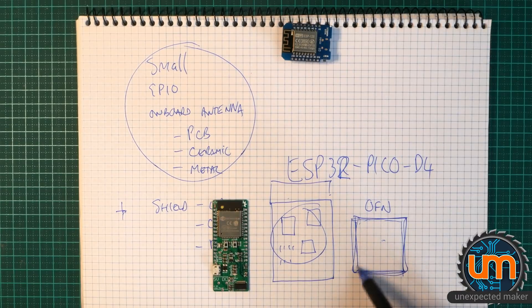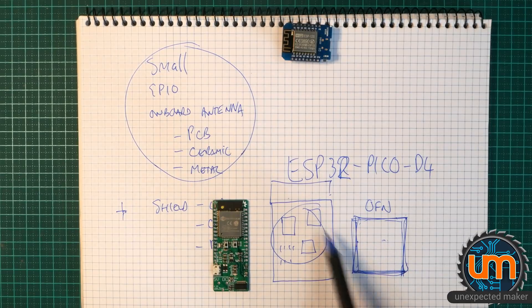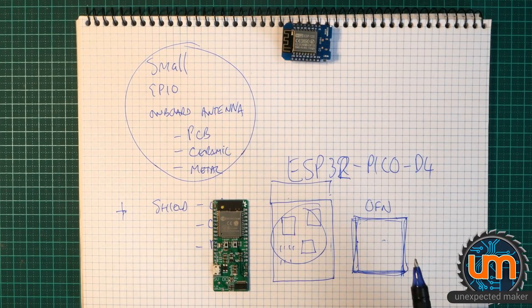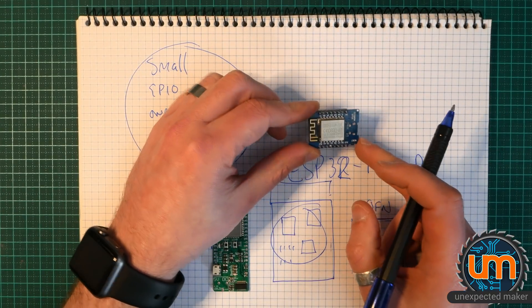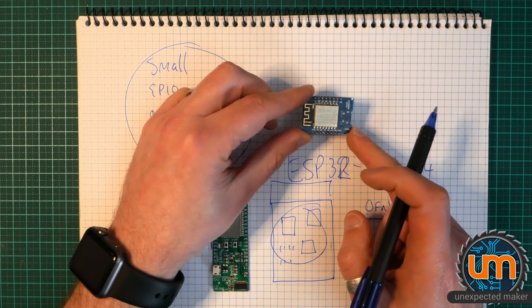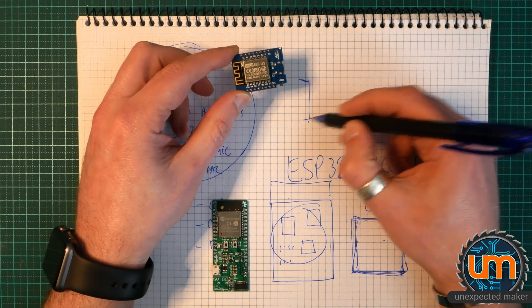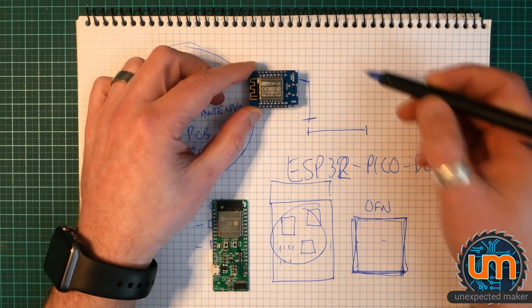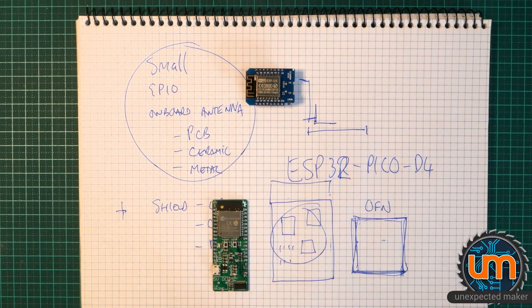The plan was to use this chip. Getting it is quite hard and they're actually more expensive than buying a complete WROOM32 module. But I thought: how small can we make a board using this chip? I took it upon myself to say — if it needs to be small, I don't want to match the D1 Mini, I want to beat it. So I started in Eagle with the dimensions for the D1 Mini and laid out everything as close to the bottom corner as I could to see how much smaller I could get it.